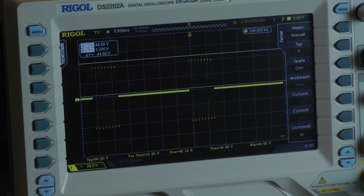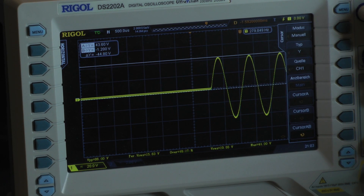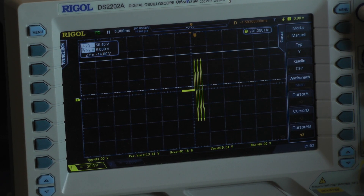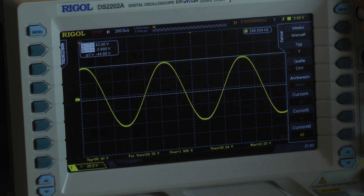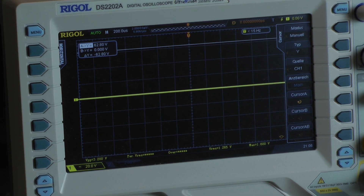Now I am testing with 8 cycles to see if there is an increase in output power. First cycle output voltage is 43.6 volts; last cycle is 42.8 volts. Now testing for maximum output power with just one cycle. Don't get me wrong — I don't recommend using the amplifier at 2 ohms mono, meaning 1 ohm per channel; it's just for testing. I check if the amplifier goes into protection, but it doesn't so far.